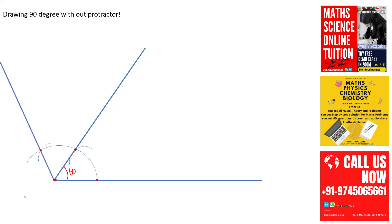Through this point of intersection draw a line, so this is also 60 degrees. So 60 plus 60 is 120, but we need 90. So we can split this 60-degree section into two — it becomes 30 and 30. For that, place the compass tip at this point of intersection and draw an arc, then place it at the other point of intersection and draw an arc. Through this new intersection, draw a line. So this is 60 and this is 30 — 60 plus 30 is 90 degrees.